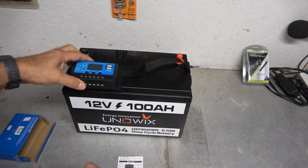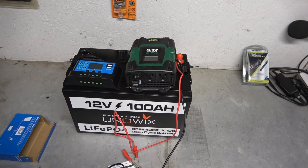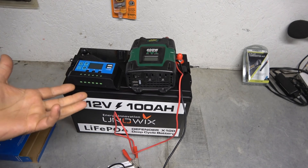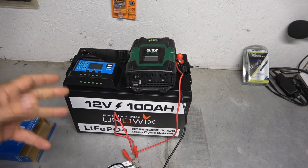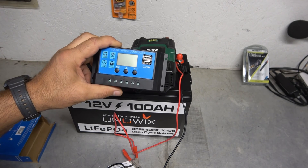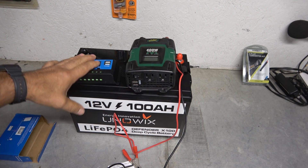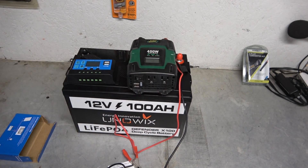So you'd have this and something like this, depending on the size you needed, and then a 100, 200, or 300 watt panel, and you've got yourself an off-grid solar array — a power station that never needs gasoline to provide you with energy. I've talked about solar a lot on my channel. I kind of thought it was so mystical and out of my league, but once I got into it, I realized it's pretty much plug and play. This converts your solar energy from the panels to something that can charge the battery. The battery then comes out to an inverter, and the inverter powers your equipment.